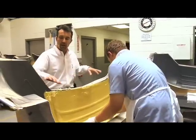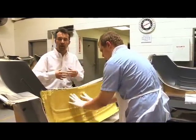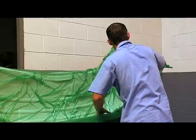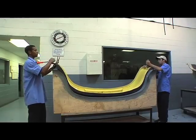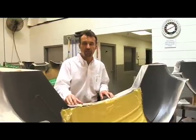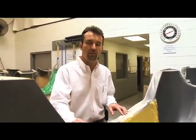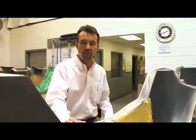Once he's complete applying all the layers of Kevlar in this mold, the next step will be applying peel ply, breather, and then finally the vacuum bag and putting it under vacuum. Then this part will be left to cure overnight and demolded the next morning, followed by an oven cure. Once complete, the part will be trimmed and then shipped down to our distributor down south for distribution to the NASCAR teams and then it goes to the racetrack.